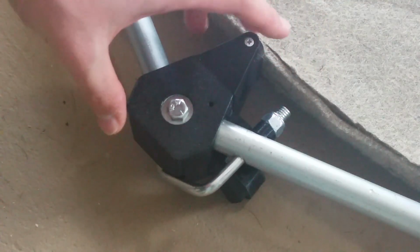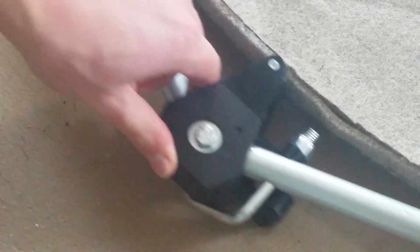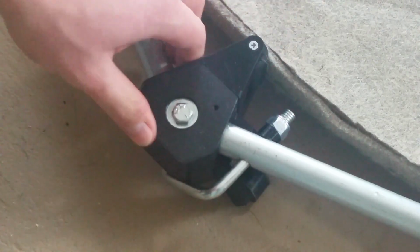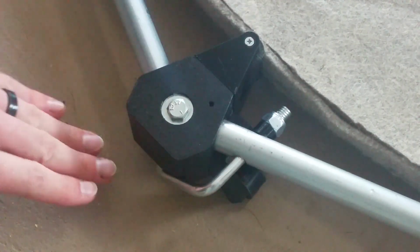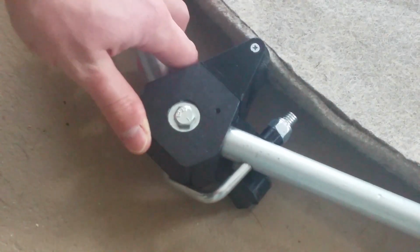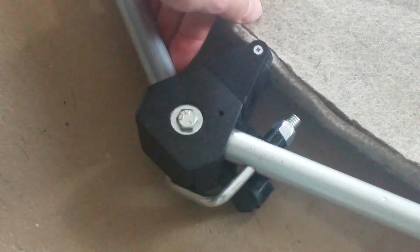So I packed a lot of functionality into each corner. There are 3 rollers in each corner. There's this roller here that rolls along the rim of the platform as it gets pushed back and forth. This ensures that it rolls very nicely. There's this roller down here that rolls on the floor. I found that the corners would dip down and even touch the floor before, so now this wheel prevents that. And then there's a roller underneath here that rolls along the underside of the platform and ensures that the whole thing can't tip, like you can't pull this whole thing up and flip it over.